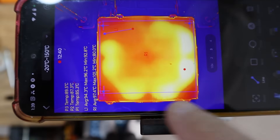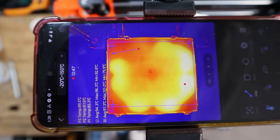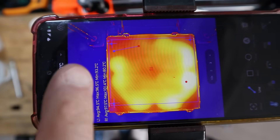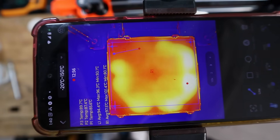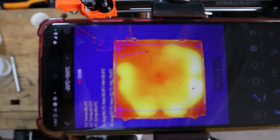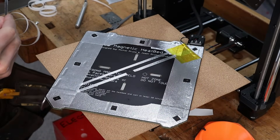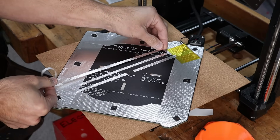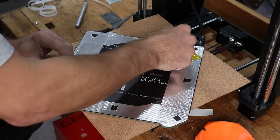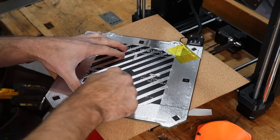With contrast turned up to better see the hot and cold zones, we have very good results. Maximum temperature is 101, minimum is 79.9 or 80 degrees in the back corner where there's only one layer of aluminum tape. The average is 97.5 and for the three corners we have 89.3, 87 and 85 degrees. I made one more change — adding an extra layer just at the very corners and strips toward the center, since we had an abrupt-looking transition there and could get slightly better overall average temperatures now that the outside was running hotter thanks to the tape and PET carbon fiber standoffs.